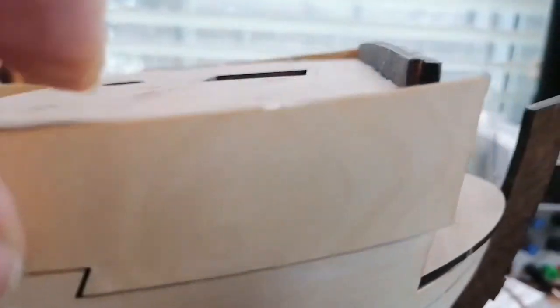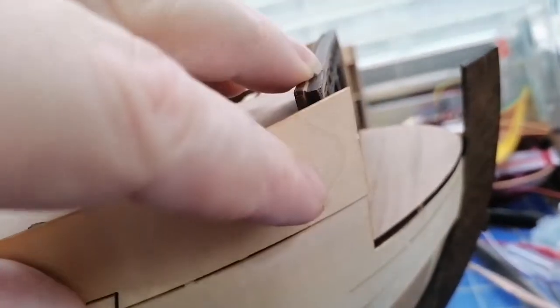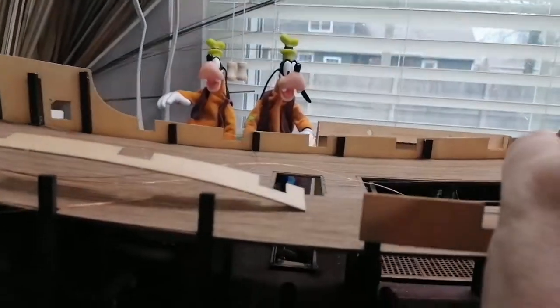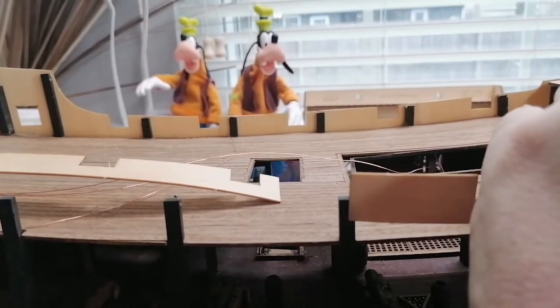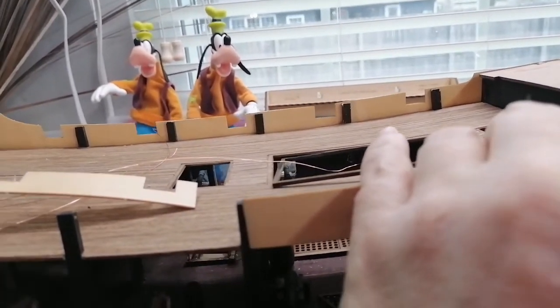The front piece was really a shock to me when I discovered it. There's a keyway right here and a keyway right here - if I line those keyways up, it lines up really nicely. But here's the problem - look at how far it overhangs. These two parts were actually miscut. This should be back to here, and once it's back to there it lines up. But it also has to come down, so it's going to take some work to get this where it's supposed to be.